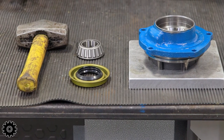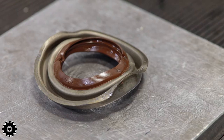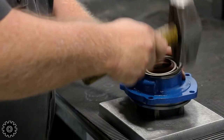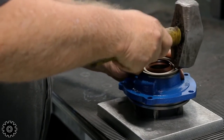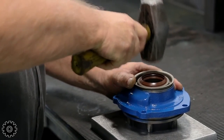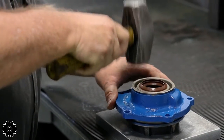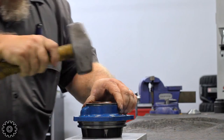When neither of those options are available, a seal can be seated with only a hammer. It is an unideal situation as a wrong hit can ruin the seal. Start with light taps until one side of the seal just barely catches, then move to the opposite side to tap it even. Each time, the seal seats a little further and all sides are kept as level as possible.